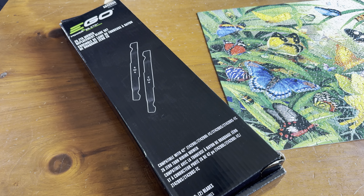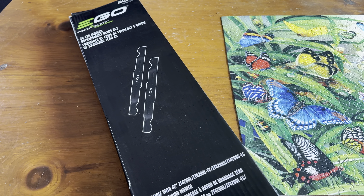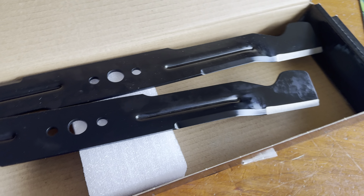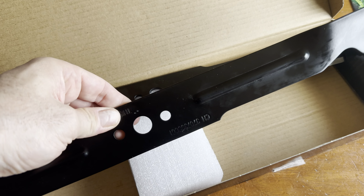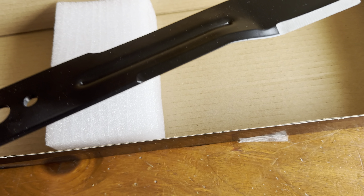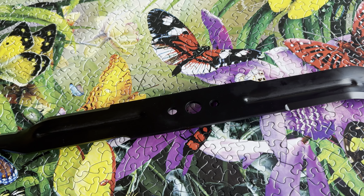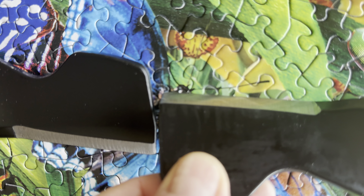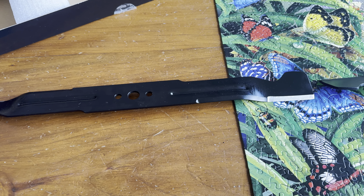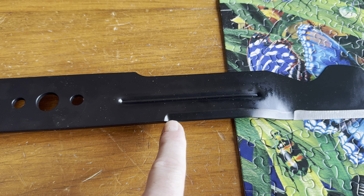But let's talk about the blade, because I think my misunderstanding was about how these blades are designed. When I reported the problem, I was like, this thing's folding the grass — they're not really cutting. So these are new blades. On one side it says 'this side faces the grass.' We're going to put that here and grab the other one — same as their instructions — that's how they would sit on the tractor. What I wanted to point out, coming back to that folding issue: this blade from this point to here is not sharp. It's dull. This section over here is sharp.